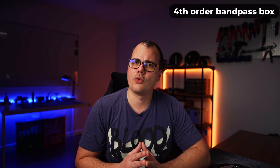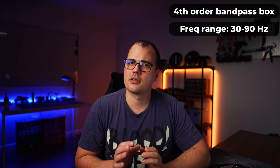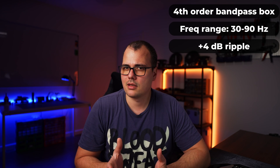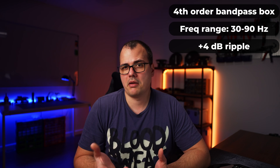In conclusion, we made a box for a cheap sub that plays from 30 Hz to 90 Hz. The response does have a 4 dB ripple — some ripple is unavoidable since this is a high QTS speaker. However, this is a low-power subwoofer and having extra efficiency at low frequencies is mainly a pro, not a con. And now the moment you're waiting for — we're going to place this sub inside the car and hit it with the full force of 100 watts and see how many dBs it scores.